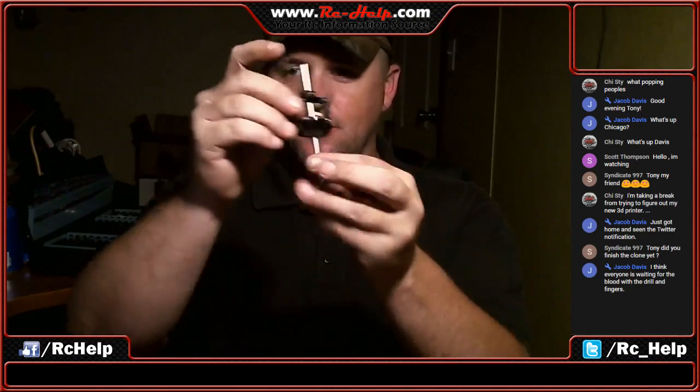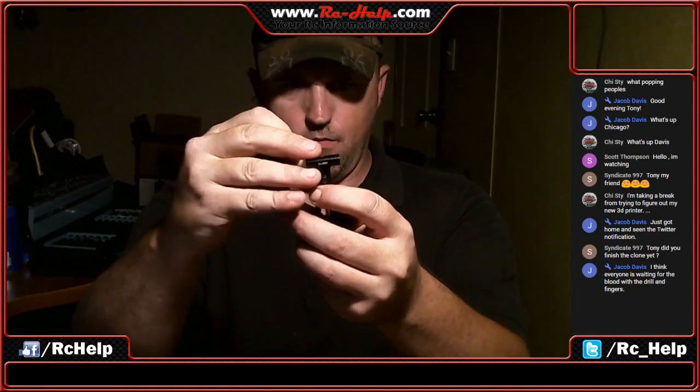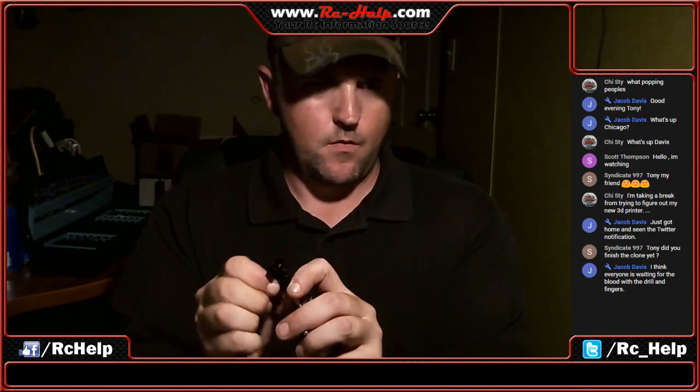All right, so just to see, because I am about as curious as you guys are, I'm going to go ahead. This is the swash plate with the swash driver. This swash driver is loose. You pinch down one of these bolts, and it pinches it on the shaft. We're going to put that on. Then we're going to take the head and put it on. Everything is without thread lock because we are just testing here. Oh, wow, that is tight. Good and tight. That just means that bolt won't be flopping around in there.